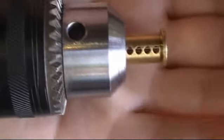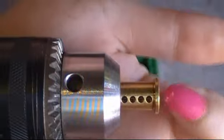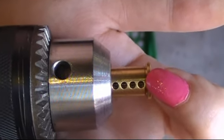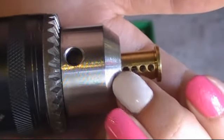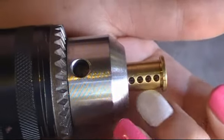The proper word for that, I forget. But I'm going to use this edge, this piece of material here, as one edge that I'm up against with the side of the file that can't cut. This piece of metal is hardened, so I'm good to touch that with the cutting edge of the file, and that gives me my 2 square edges. Hopefully.